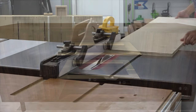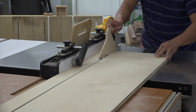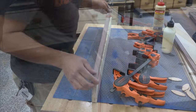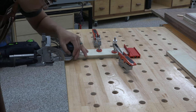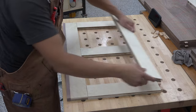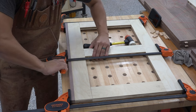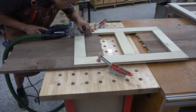Next I started working on the drawer dividers. I decided to construct the drawer dividers as a web frame made from three inch strips of maple plywood, kind of like rails and stiles to a frame and panel door. I also added a strip of solid walnut nosing along the front rail of the drawer dividers. I then only mortised the ends of the front and back rail to the center vertical dividers, and not the stiles.